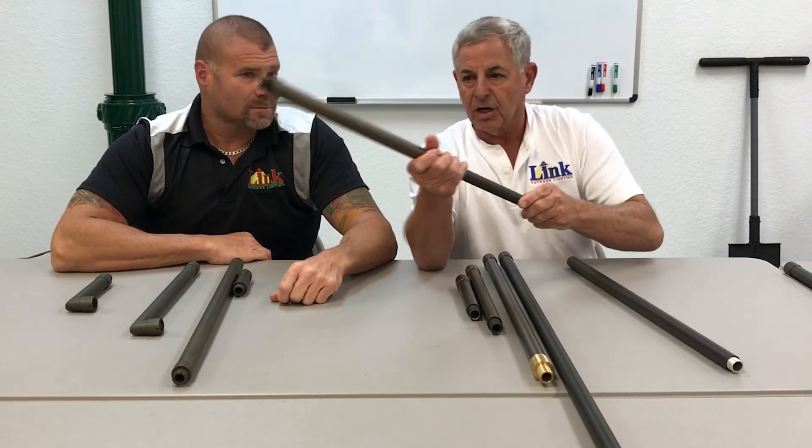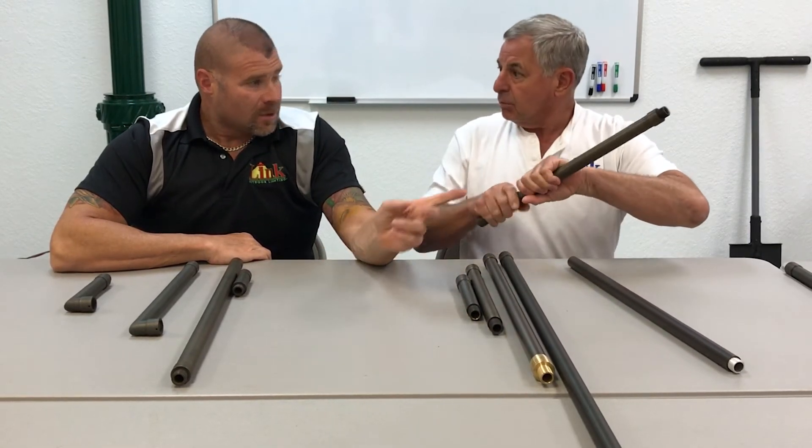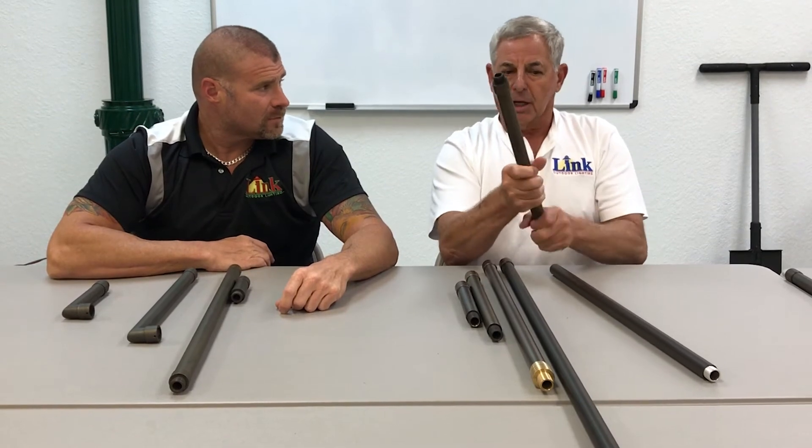Here's something trick — we've got from Luma Care, we've showed you guys this before. It's an adjustable riser, very cool, and it's really not much more expensive than our direct risers. It adjusts from 20 to 32 inches. It's got a little jam nut there — you tighten it up, you can stretch it out. Remember to push a little extra wire up in when you set it up so you can adjust it out.